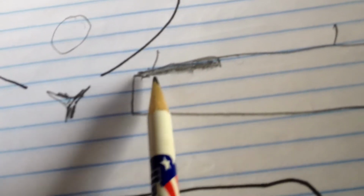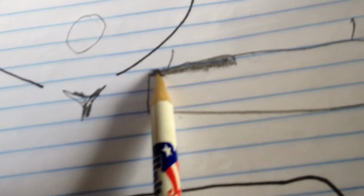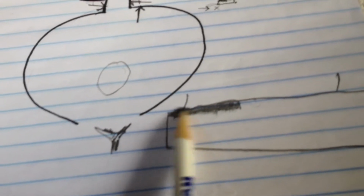But always remember that you can take metal off, but you're not going to be able to put it back on. That's going to be difficult. You can, but you're not going to be able to do it with just basic tools, adding metal. So just start relieving here a little bit and then fit it. You might have to fit this thing like 1,000 times when you do this.